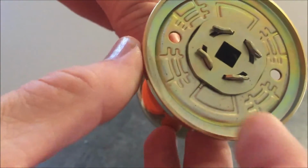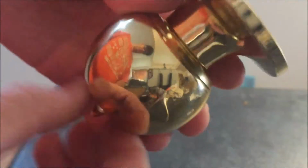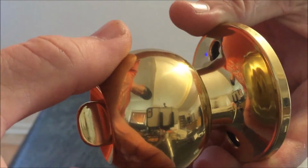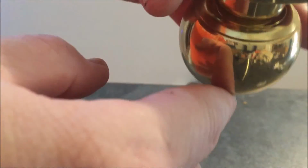The inside knob is held together by lugs very similar to the outside knob. The inside might not seem so critical for security reasons, but if you're fitting it to a heavy door, especially if it's got a door closer fitted to it, pulling on that inside handle could cause problems. It could even rip the handle off.